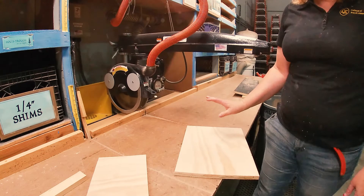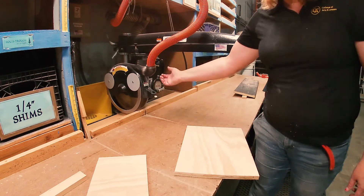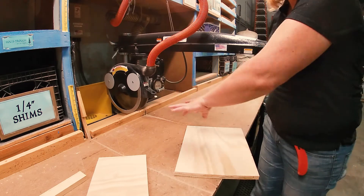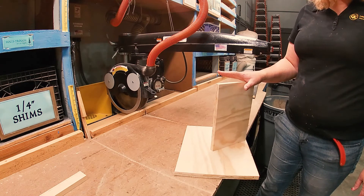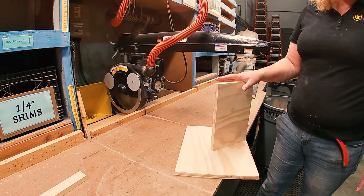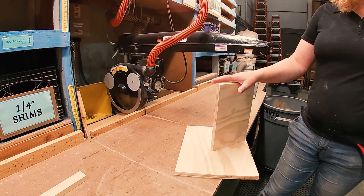Just be aware that as you're pulling stuff out, if a chunk of wood happened to go flying in there and caught the blade, the whole thing could launch forward at you — and if you're no longer holding it, that's why you want to stay clear while the blade's spinning down. You'll notice on that cut it was very noisy, which is indicative of the blade being dull and chipped with buildup of pitch and gum from the sap, so the blade needs to be replaced.